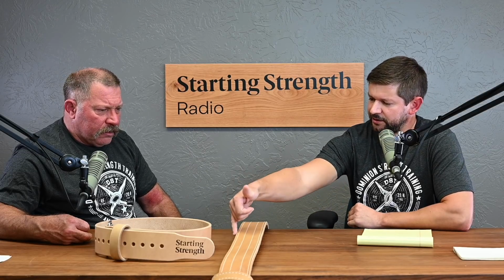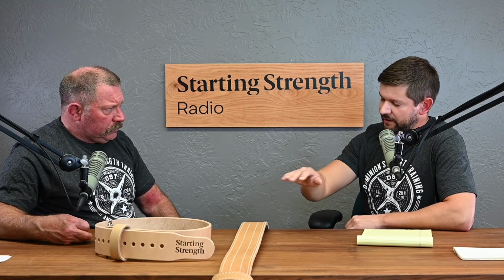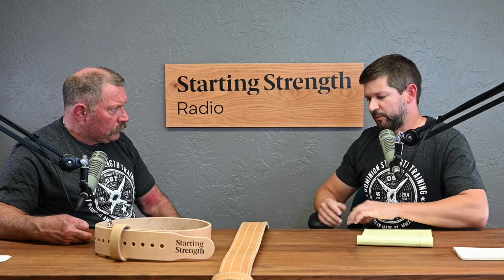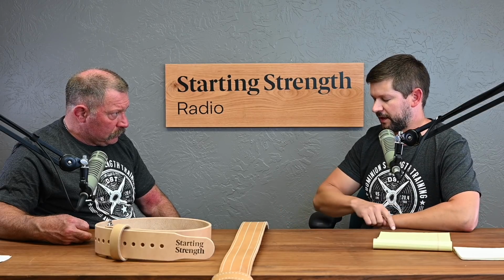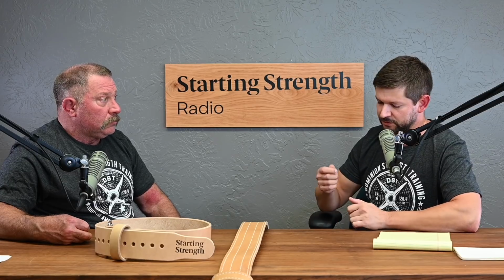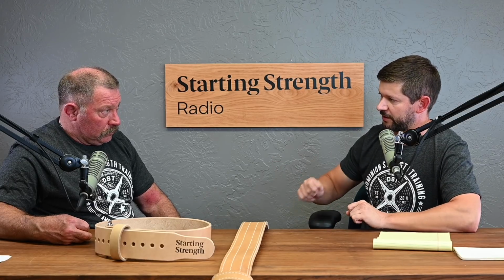And they do pretty good. They'll start out and cut a straight edge down one edge, and then they'll have a guide that they feed it through. And then we've got a fixture at our shop. If we get them in and there's any more than a half inch of bend in one, we'll case it. So we'll soak it in water, and we'll hammer it down into this fixture that is exactly 3 inches wide, leave it overnight and let it dry.